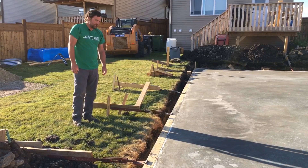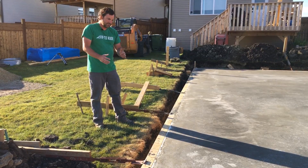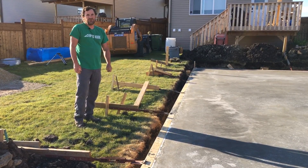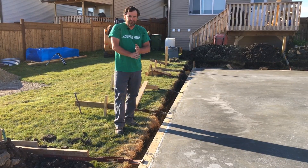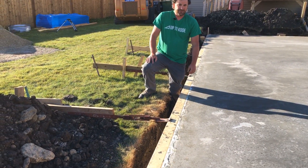It was just a simple mistake, but it shows you a couple of tips. Push this wall inward — if I would have staked this a little bit better it would have been zero hassles, just a seamless pour. And I think the other big thing is having this L tie at the top, which allows you way less bracing and gives you more strength.